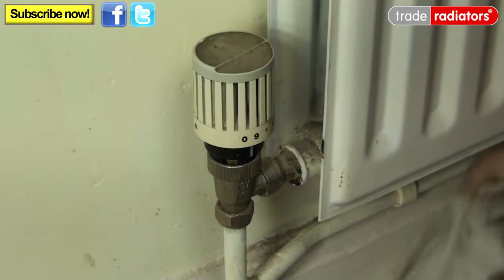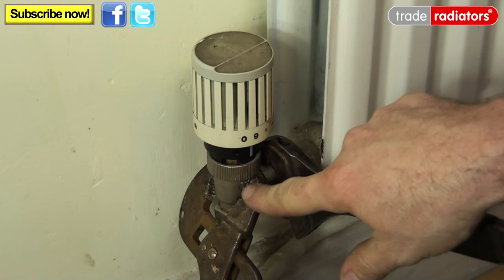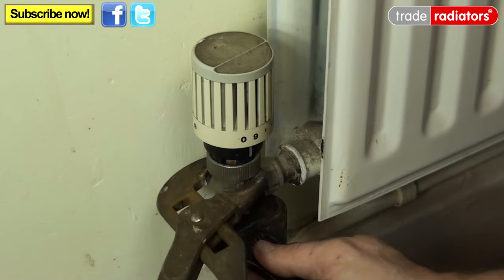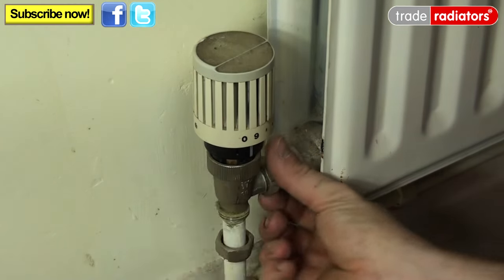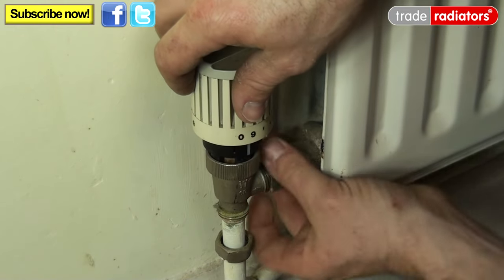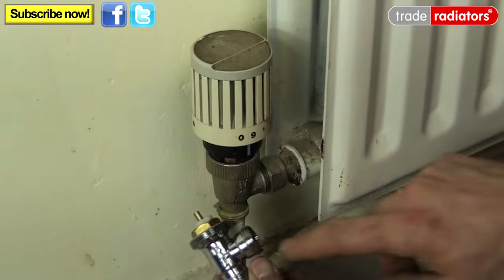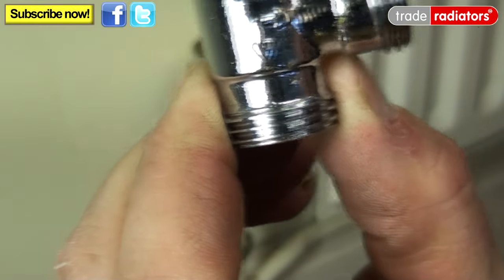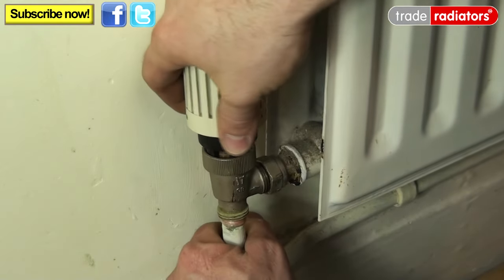Put a small towel just under here to keep everything nice and safe. Then undo the nut off here and the nut off there. Get a pair of grips on the body of the TRV and push down to undo this nut, then slacken the other one off. Before taking it fully off, undo that one as well. Once you've got them both loosened off you should just be able to slacken it by hand. You'll notice on this body there's an arrow pointing the way the flow comes from the boiler into the radiator. The new TRV has an arrow that points both ways — it's called a universal thermostatic radiator valve. There might be a little bit of water still in the bottom of the radiator and the pipe, and there we go — that's off now.